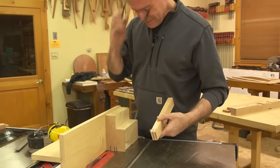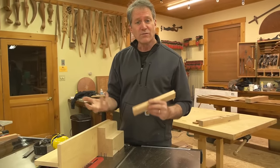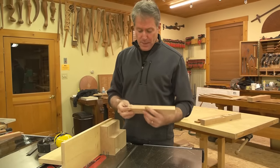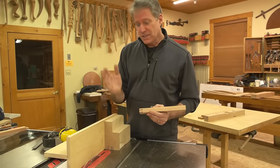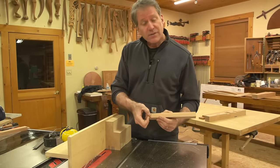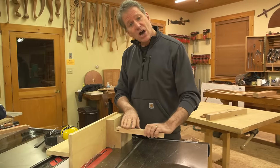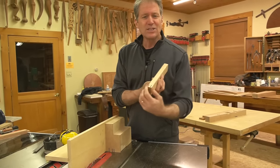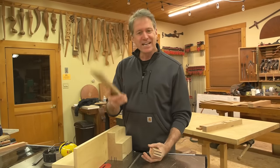Okay, now I'm usually cutting 7/8 long tenons for chairs and rails, in general, table rails, but I don't raise the blade all the way to the 7/8 when cutting these cheeks. So we've got it a little less than 7/8. Then I would just drop the blade, set the stop to 7/8 and make my shoulder cuts. But right now I just wanted to show you the genius of this jig and the tenon spacer.